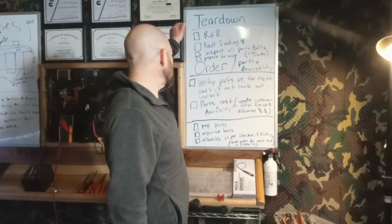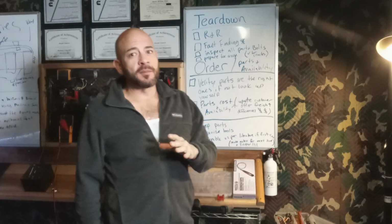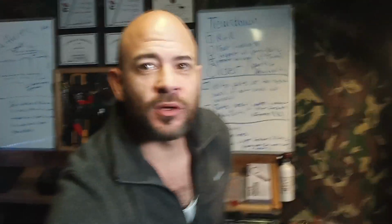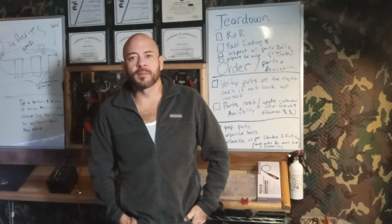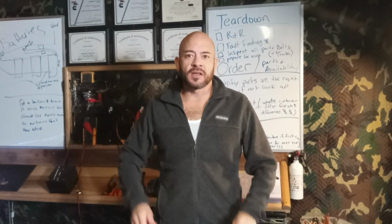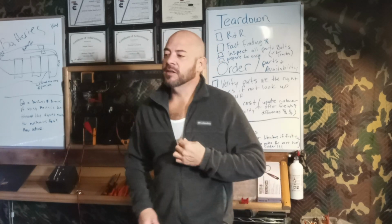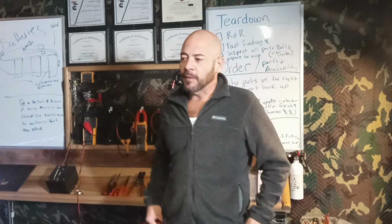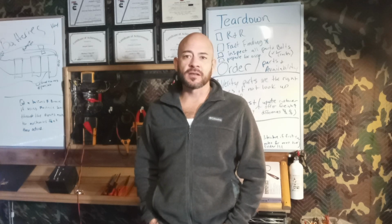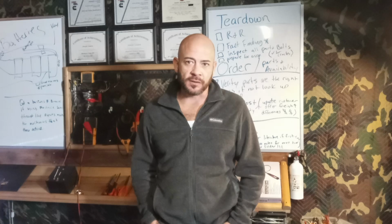Okay. So, one thing to note before we start with teardown is, are we on a fact-finding mission? That means that if I am on a fact-finding mission, then I'm going to do certain things differently, right? So I'm going to tear things down. I'm going to use a digital torque wrench or some means in a reverse torque to see what the breaking torque is. There's other things that I have to consider when I'm taking things apart. If I'm trying to find out what's going on with said cylinder, I need to be taking the top end apart, trying to find out, is anything different about this cylinder?